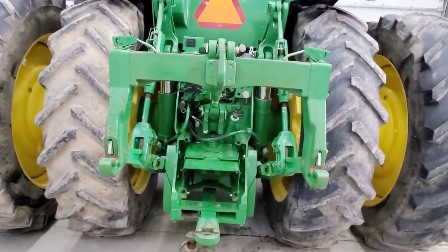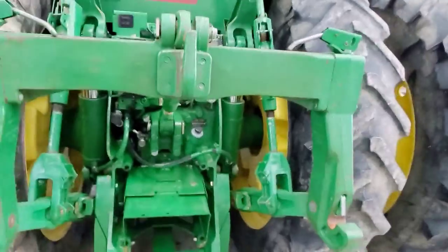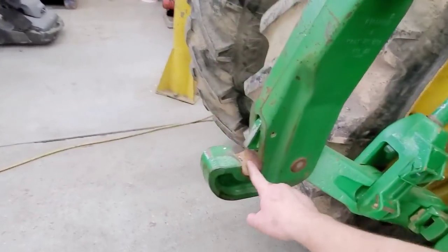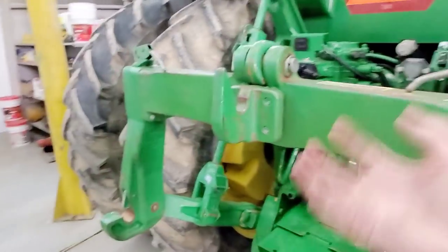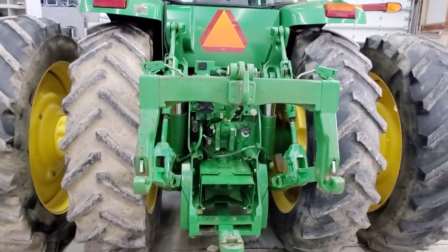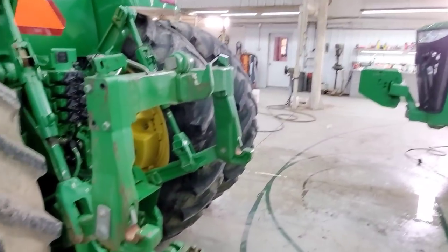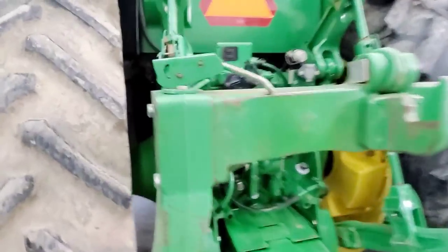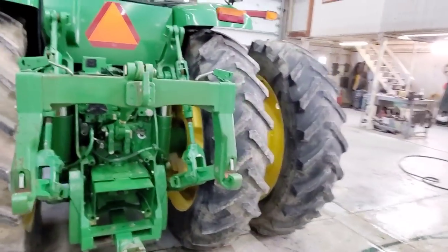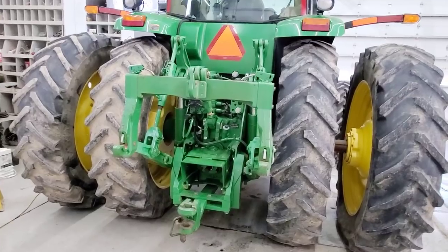Moving on — three point hitch is what we call this other attachment point on the back of the tractor. This actually has a quick hitch on it. Our implements will have a pin that'll go in here, one on the other side, and then a top one that fits in here, and it lifts up and down from that. That's why it's called three point hitch — one, two, three, right? On the planters it's actually what we call a two point hitch, so it uses the two bottom pegs but not the top one. Either way, it moves up and down with these big hydraulic cylinders to put the implement in or out of the ground, or in the case of planters, to lower and raise the tongue to level the planter units. So that's what I mean by three point hitch in case you were wondering.